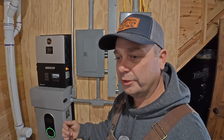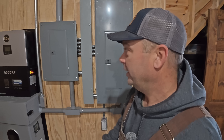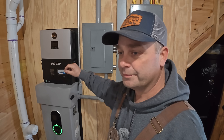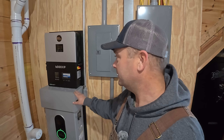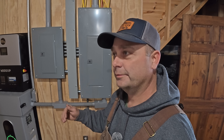If we lose grid power during the snowstorm, we'd minimize use of the larger loads — no oven, no dryer — to get the EP Cube batteries to last as long as possible. All critical loads will be run by the 6000 XP, which with its current battery size will run those loads for probably around 18 hours. Once that battery is drained, it switches to what it thinks is grid power but is actually the EP Cube system, so we'd start draining its batteries for essential loads — hopefully lasting over 24 hours total on just batteries.